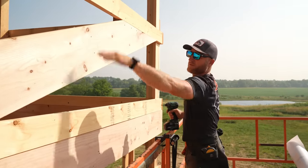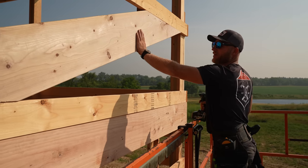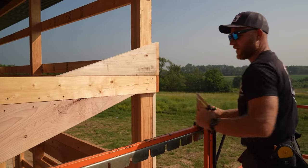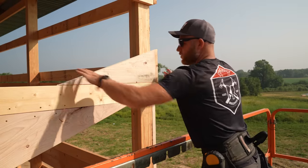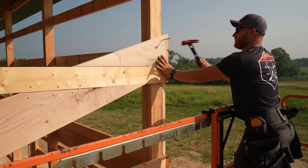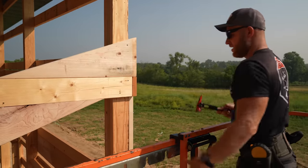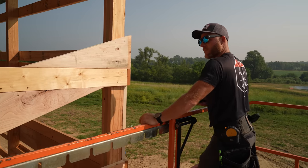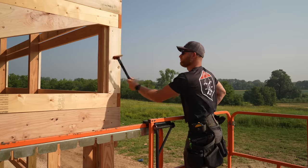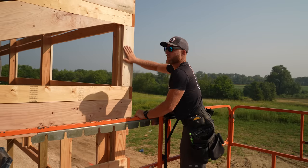So now I've got a place to screw my steel as it comes in. I'm gonna have more framing tying into this, but for now I just need this here before I house wrap this corner. Right there is the peak, and then it goes back downhill here, so if I just take this scrap piece of 2x12 I cut off it can become my backing up here. All right, blocking done. That'll do it — if I've got to attach something here, that's done. This is all ready for house wrap.